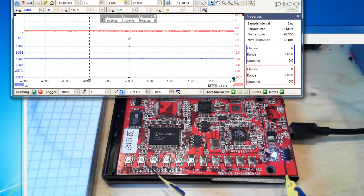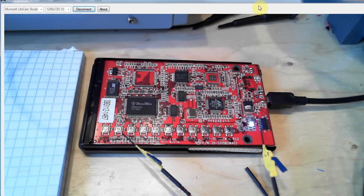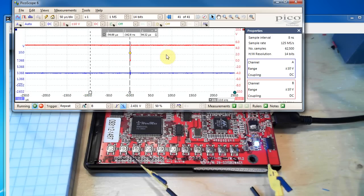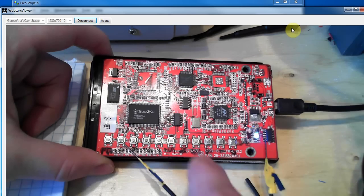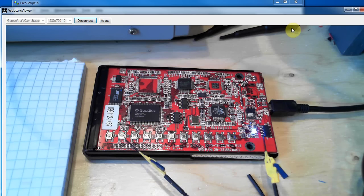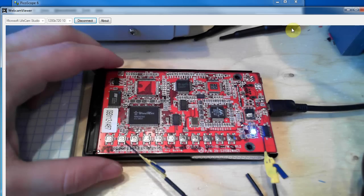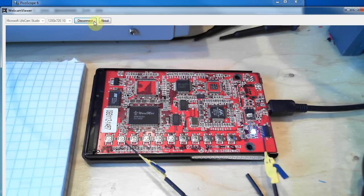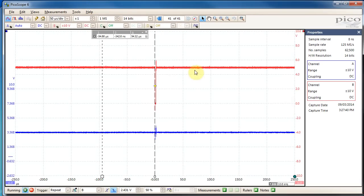Six would work, so the drive remounts and we've recovered the entire PIN. This is a timing attack in real life. I'm using an oscilloscope, but you could do this with a logic analyzer or a Bus Pirate type thing. You will get this effect anywhere a PIN is stored in plain format rather than as a hash — which is pretty common in simpler embedded devices like security systems. I'm also going to have training courses at Black Hat USA 2014 covering these types of attacks including power analysis.